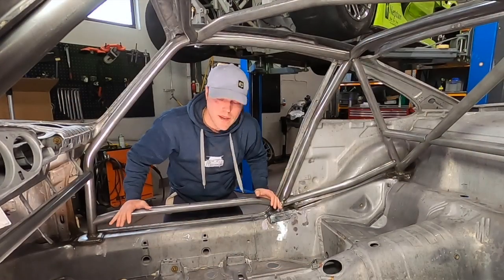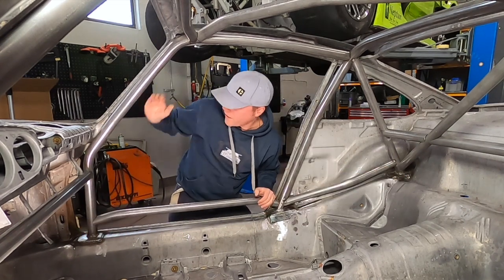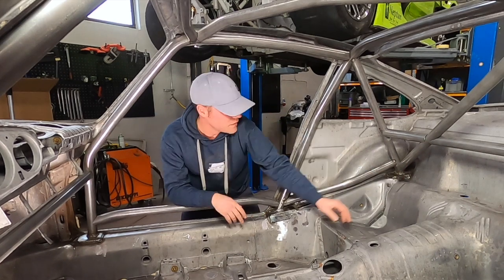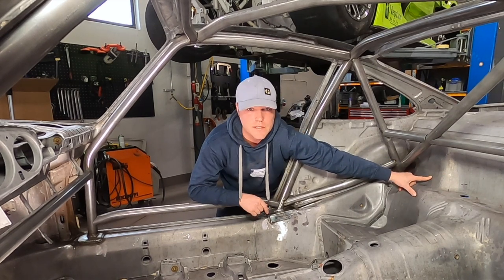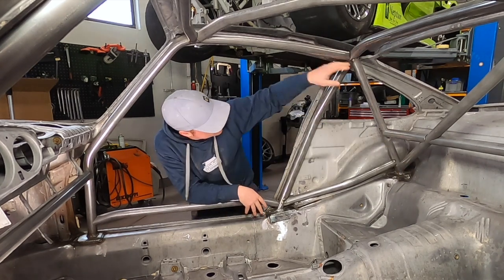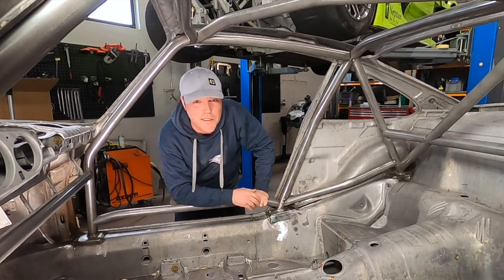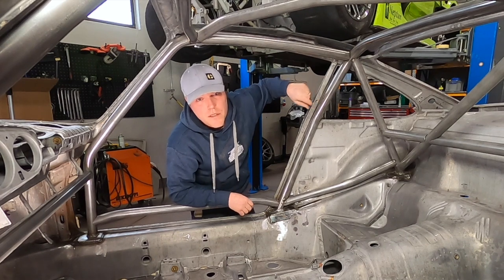This is how we've attached the roll cage to the main chassis beam of the car. We have the front mounting point where the cage comes down, the center mount by the B pillar, and then the rearward one. One important aspect is that the front point needs to be in front of the main suspension mount on the 964, so we get a nice mount into the chassis beam. We have a cross on the back where the seatbelts are going to go. In Sweden you need two sets of seatbelts for the annual inspection, since this car is going to be road legal.